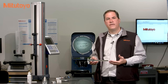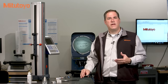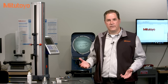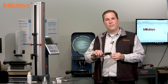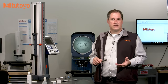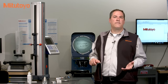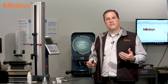There are other configurations of calipers out there, and after watching this episode, you should be able to extend what we discuss to the calibration of all types of calipers. For all of our measurements, we will want to properly use the caliper. The most important skill in calibrating calipers is simply using it correctly. If you're having some struggles getting good results, find yourself a caliper that's known to be in good condition, grab some reference standards, and practice. It doesn't take too long to get the right feel.